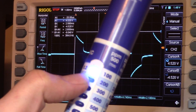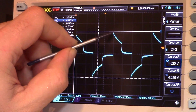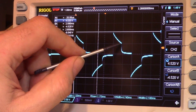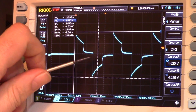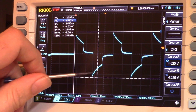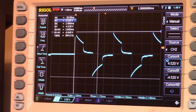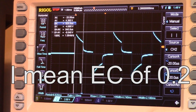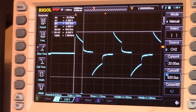There's a reading of 0.2 EC. We get a waveform where, although we're still charging up to the 4.5 volt value at the start, this is no longer staying high for 2.6 milliseconds — in fact it's ramping down straight away until it hits a value of about 2 volts, then we seem to be zeroed off. The same thing's happening in the negative: pulled down to minus 4.5 volts, then ramping down to about minus 2 volts, then pulled back to ground. I suspect what's going on here is a capacitor-based ADC. With our EC of 0.2, we're taking just under a millisecond — 940 microseconds — to drop down to this 2 volt level.